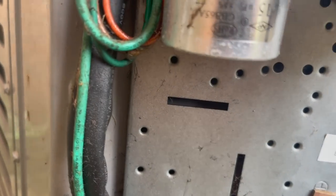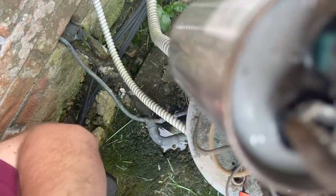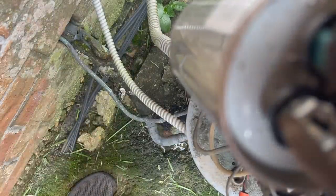So I knew I had two separate capacitors. There's the fan - it's a 15, that's ridiculous - and it's wet up there. Here's the compressor one, I can't even tell what it is, but it's been replaced. That fan motor capacitor is original - it's an old Chinese capacitor with a long screw in it. And here comes the rain.